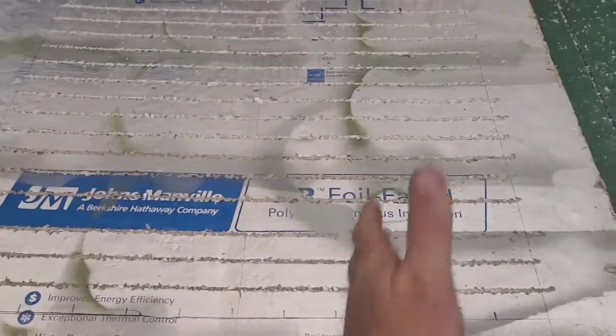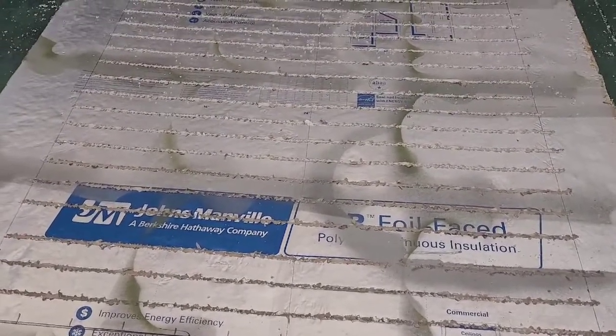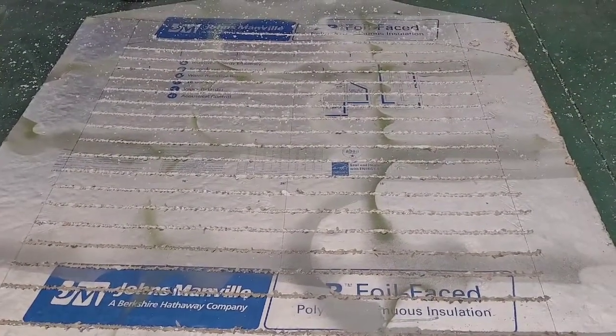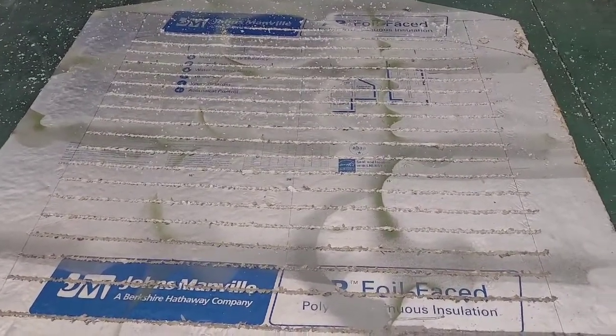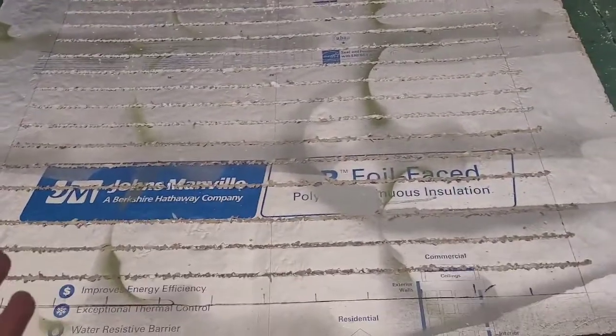The next step of this process is your verticals. Now, what I like to do is try to make it as simple as possible. Since I always use 48 inches as my overall, because it's a nice even number, plus the sheets only come 48, so you can maximize how much you get out of a sheet. By taking off 6 inches on either side, that leaves me 36 in the center.